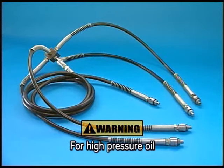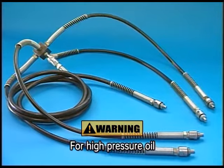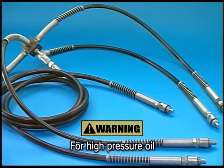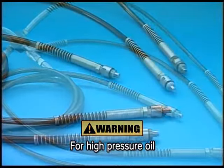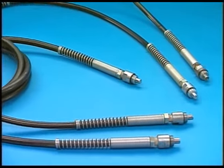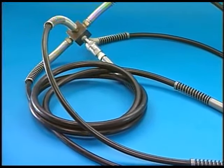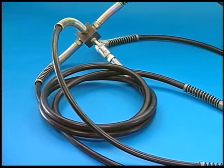A leak of hydraulic fluid while using the hydraulic jack could lead to the spout of the fluid under high pressure and result in physical injury. Therefore, don't use the hydraulic jack with a rubber hose having a flaw or an oil leaking portion. Furthermore, don't burn the outside of the rubber hose and don't bring your face close to the jack or branch during the procedure.